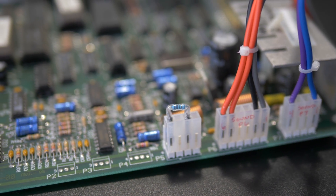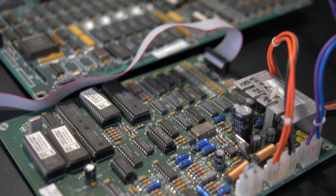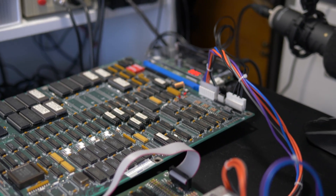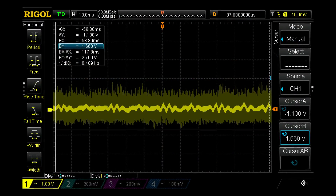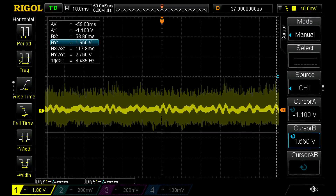As a note, no two arcade boards are the same. I also tested this on a second MK1 board and it required slightly more resistance than the first. I was able to get both to output safe, line-level compatible voltage, but it's not as easy as just saying 'use a 12k resistor on MK1.' You'll need to test and adjust each one individually.